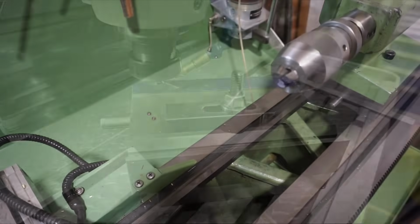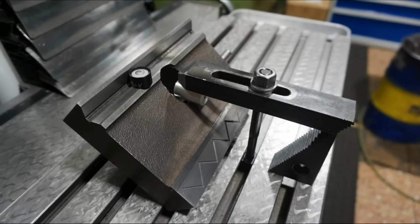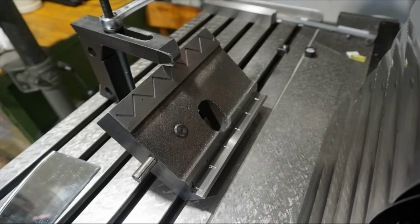It happens. And thereby there is a risk that some dirt gets underneath here. And I wanted to give this dirt a chance to get caught by a lubrication pocket before it wears all the length of the tailstock slide surface. The lubrication pockets on the prismatic slide surface are pretty much the same thing as on the bed slide, leveling in with the circular level and then machining these ports that are shorter than the contact patch with the bed slide, again to prevent oil from draining down.